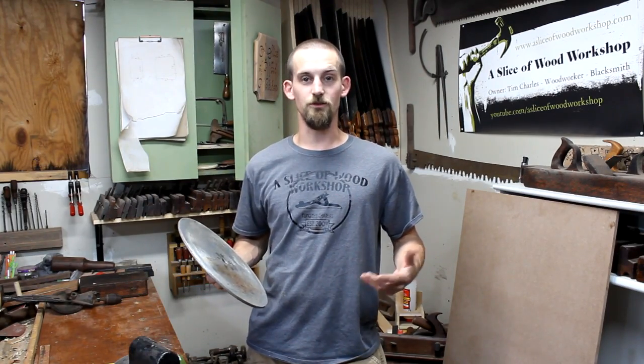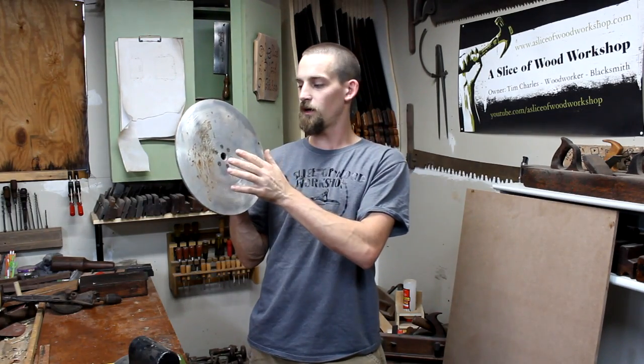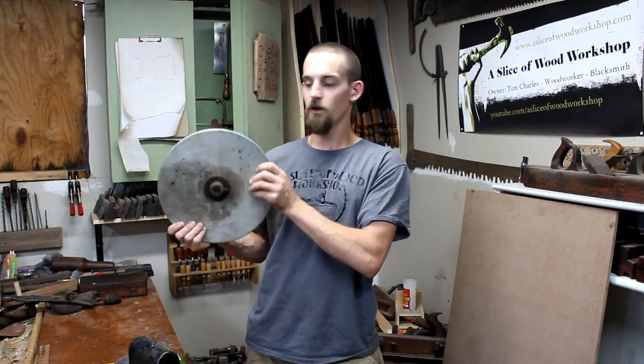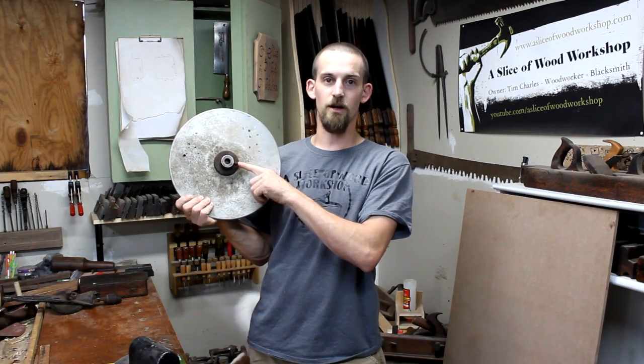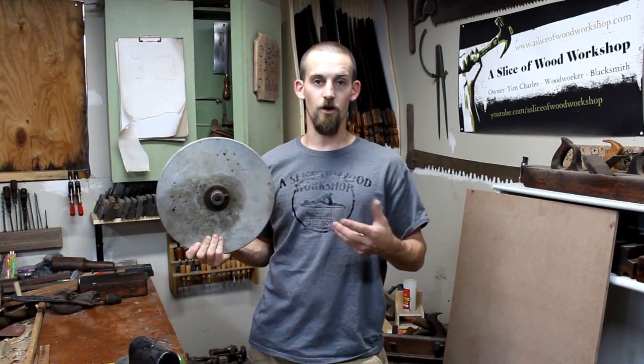Another thing that you're going to want to either build or pick up is your main wheel. This one is going to get mounted right to the shaft of my motor, and it's got a set screw right here that will lock it down tight onto that shaft. Now, if you're going to make your own, you can do that out of MDF or any kind of other hardwood.